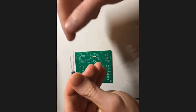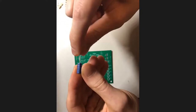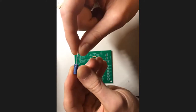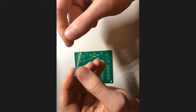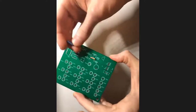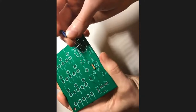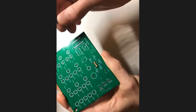And also the easier way to remember which side is positive and which is negative is the fact that there is a gray stripe next to one of the leads with a negative sign on it. And this side is always, of course, the negative side of the capacitor. So I believe I mentioned before that in our particular case, we'll have the negative side or the gray stripe side going to the square pad on our capacitors. And our capacitors are marked C1 and C2.